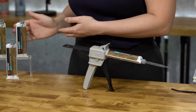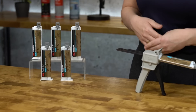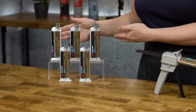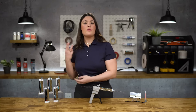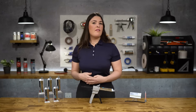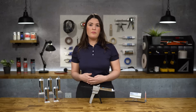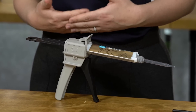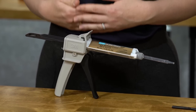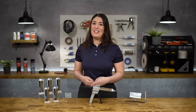The 3M 8600NS series also offers low bond line read-through with minimal exotherm. Next on the table we have 3M 8700NS. The 3M 8700NS series has three different time variations — 5 minute, 10 minute, and 25 minutes — to accommodate many applications. Its non-flammable classification and low odor formulation help improve the workplace environment, while maintaining structural integrity in extreme temperatures down to negative 40 degrees.